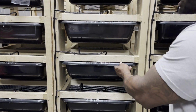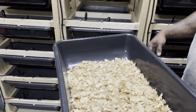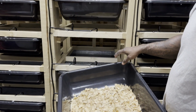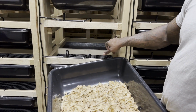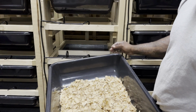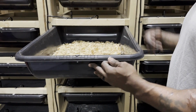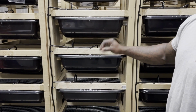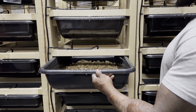So this is one of the examples of what we decided to do. As you see, I have 2 nozzles in there already clipped in. One of the designs that I put into this build was we didn't run the drawer guides all the way to full length. The reason is now we can put the top lip in and slide it in, and I don't have to unclip the nozzles every single time we slide these drawers in and out. And they're fully supported the entire time.